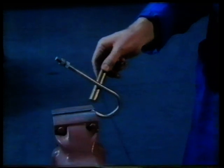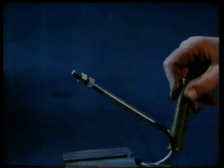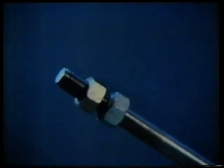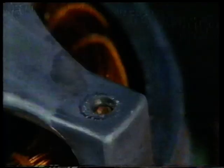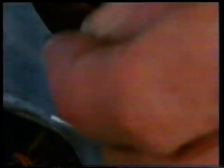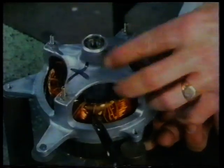It could have been worse. This nut is out of round — as you tighten it onto the bolt the two threads jam together. Compare it with an ordinary nut: the out-of-round one stays locked onto the bolt. It's one of a whole class of fastenings called stiff nuts. This one locks onto the bolt because of a nylon insert; it stays on even if there's no tension in the bolt. In this kind of light assembly work you can use a lock washer to keep the nut in place — this one increases friction between the assembly and the nut by means of teeth which bite into the two surfaces.